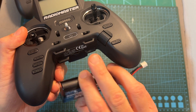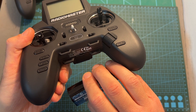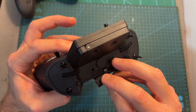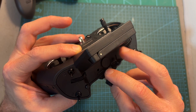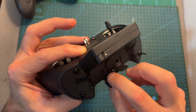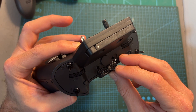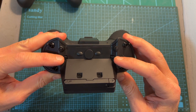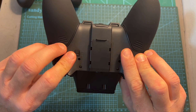To secure a battery on the bottom of the Zorro, you can use the plastic parts along with the provided Velcro straps, and also use them to secure the plastic part that prevents the balance plug from accidentally disconnecting. On the top side of the Zorro, you can find an audio and trainer 3.5mm port, a micro SD card slot — a 256MB micro SD card is included — and a USB Type-C port for connecting to a computer to access the SD card, use it with flight simulators, and update the internal ExpressLRS module. The available switches on the top side include two 3-position switches, two potentiometers, two 2-position switches, two momentary switches, and on the back side another two momentary switches.